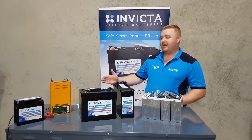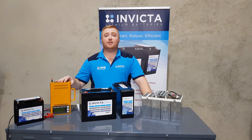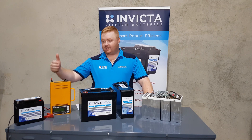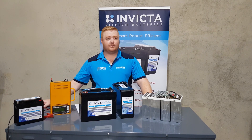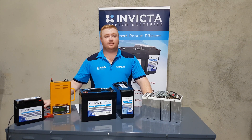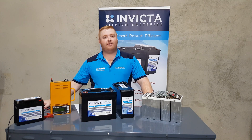So how we're going to demonstrate that is with our discharge tester — a 20 amp constant discharger. We start at about 12.8 to 13 volts and discharge all the way down to 100%, and by that we get a time on that. What this will do is show in the app itself. We'll have some videos showing it going down to 1% discharge and 0% cutting out, and after that we'll show our chargers.